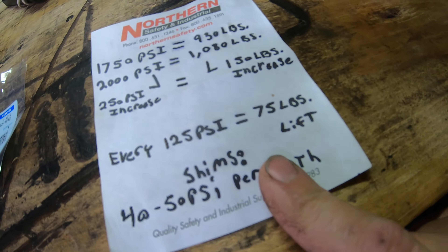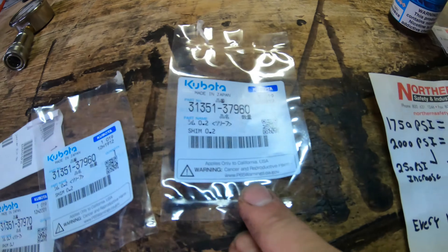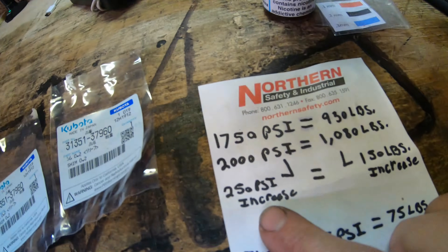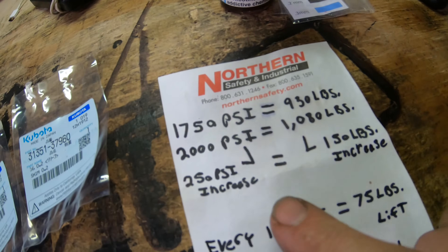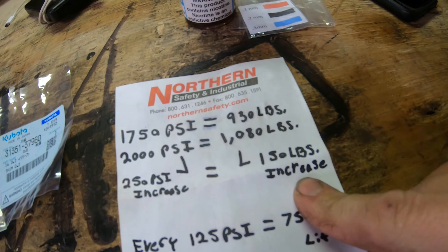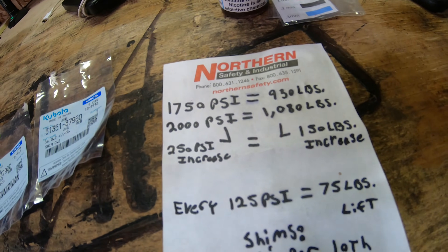Given our cheat sheet from last time, a tenth gives us 40 to 50 PSI, so let's say a tenth is 50 PSI. This is going to gain me roughly 250 PSI of increase — each 0.2 is 100 PSI and the 0.1 is 50 PSI, give or take. So that's 250 PSI of an increase in hydraulic pressure. And from our cheat sheet, we can see that 250 PSI of increase last time gained me 150 pounds of increased lift. So I'm looking at getting another 250 PSI of hydraulic pressure, and I'm assuming I'm going to get another 150 pounds of lift. This could be really beneficial for lifting stone and breaking out tough material like clay. I'm excited to try this out because I do work this thing to death, and it would definitely be nice to have a little bit more breakout force and loader strength.